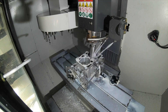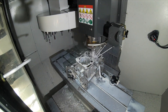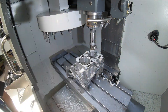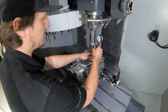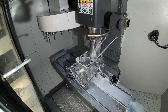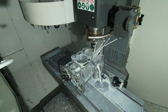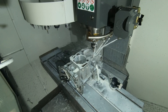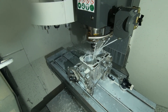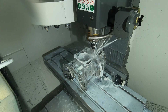But with this tool and with the CNC it is much easier than with a normal engine boring bar. What is most important to me is that it is much more accurate and the surface finish is much better than with a normal boring bar. Here I check the diameter again, then I change the cutter for aluminum only. Here you can see I do the upper part where the sleeve sits in the engine case with the flat mill. That is very important — and that's why I find it so good to do with the CNC — because you often hear that the sleeve drops, and that's because the seating area is not completely straight. When you do it with a flat mill like this, it is perfect.